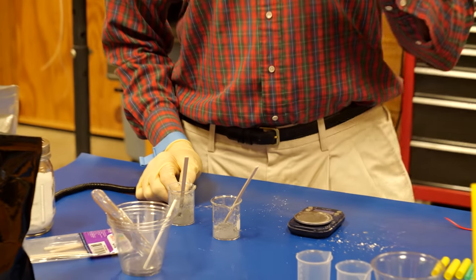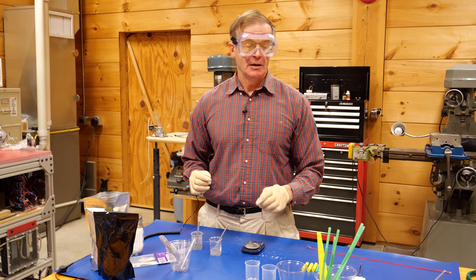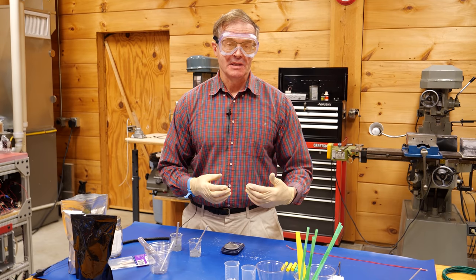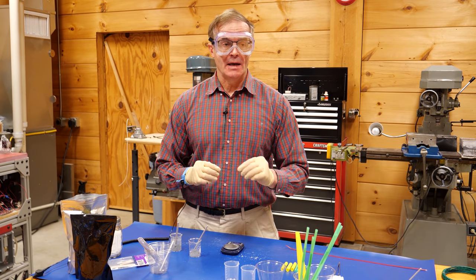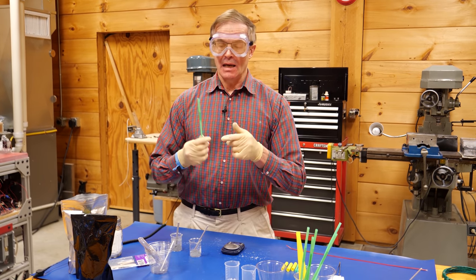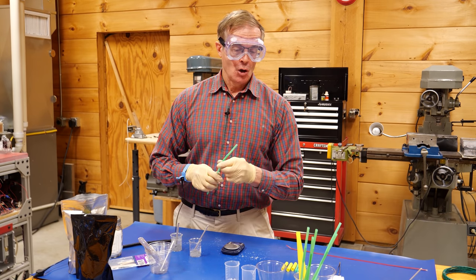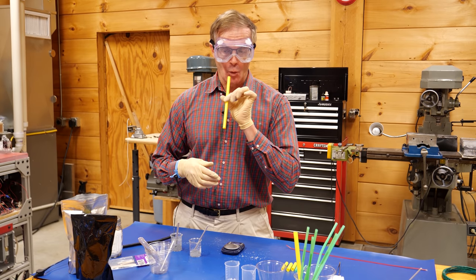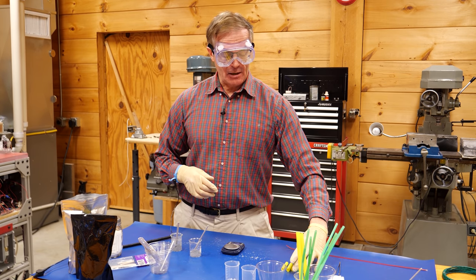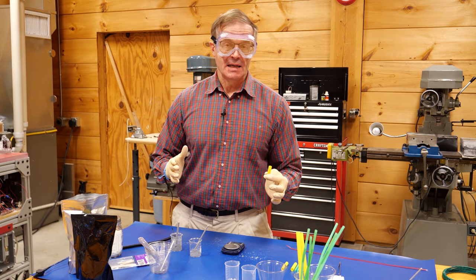Now that they're mixed, we need to get these to surround the starter, because this is basically an amplifier. We need to hold the material in a way that we can still insert it into the engine. I've tried mixing this into pastes and wrapping it in little tubes, but I found the easiest way is simply a soda straw. Standard flex straws or milkshake straws — cut down to two-inch or five-centimeter segments — create a really nice starter housing.